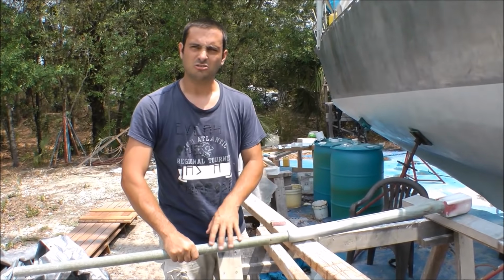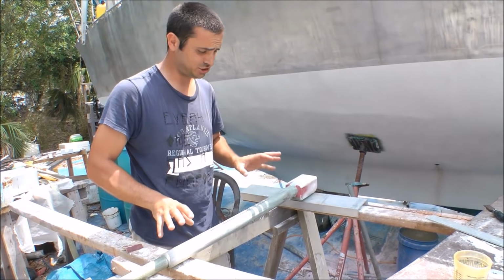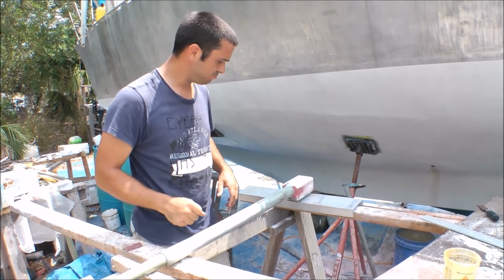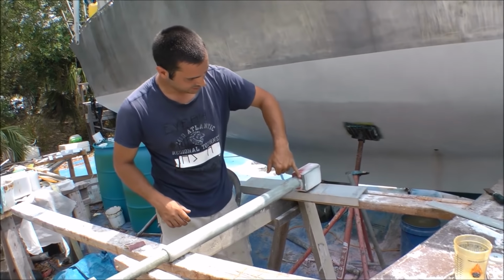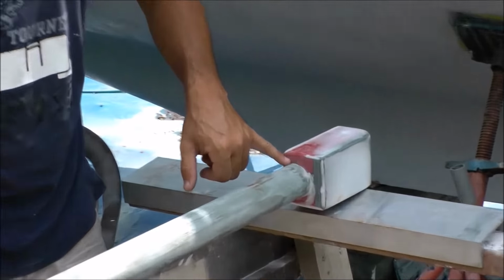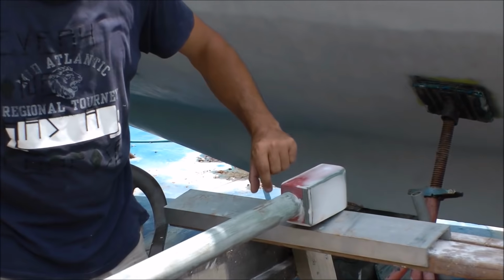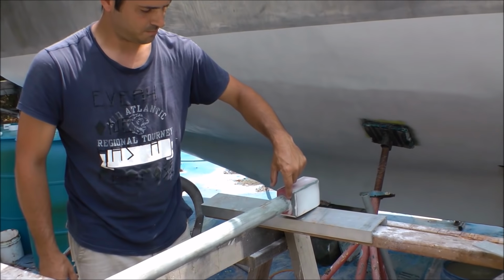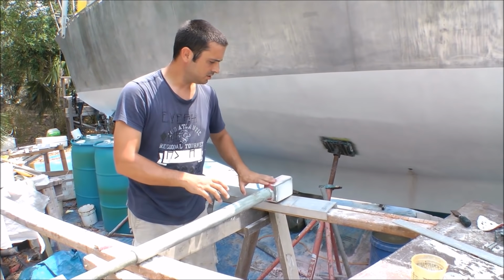And to make it, I just used pre-bought fiberglass tubes, 1/4 inch thick. So it should be, per my calculation, strong enough for a 200-pound person pulling on it. Back here, this is actually all solid fiberglass. You can see the lamination of it, so curved out. This is GPO3, the electrical grade fiberglass, in 1-inch pieces on either side. Then top and bottom is 1 layer, and then 3 layers of 3/16 regular FR4.